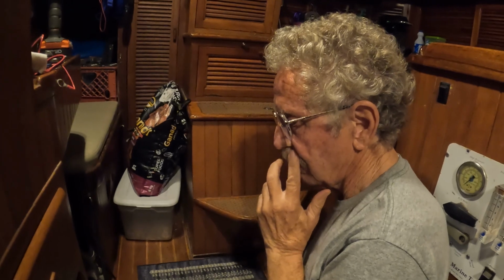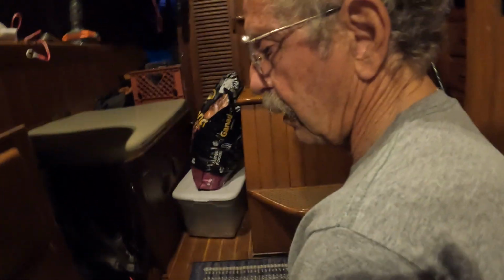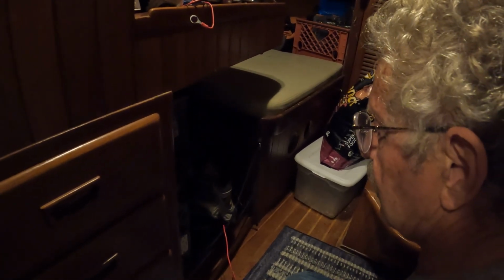In the evening, Lee, after vacuuming up the dog hair, tripped the circuit breaker. Okay, everything went off. What's the numbers at now? It says 2.3 amps. So now what does it show? You disconnected the BMS? No, I'm going to disconnect the charging circuit. What does it show? It shows 0 amps. So when you say charging circuit, what do you mean? It includes the shore power charging, the alternator charging, and the solar charging. Oh, okay. So we took the solar off it the other night and didn't change anything. That probably is not it.